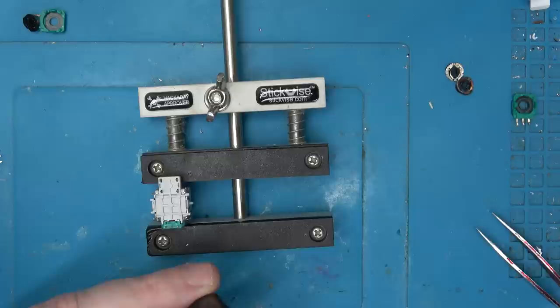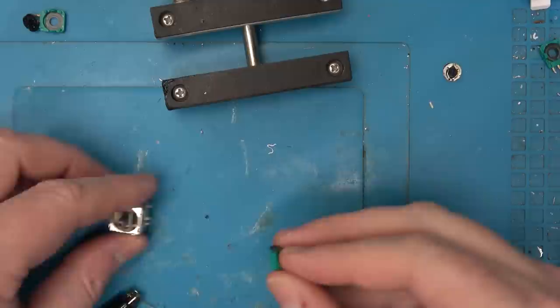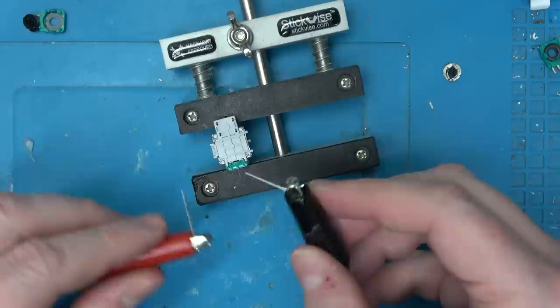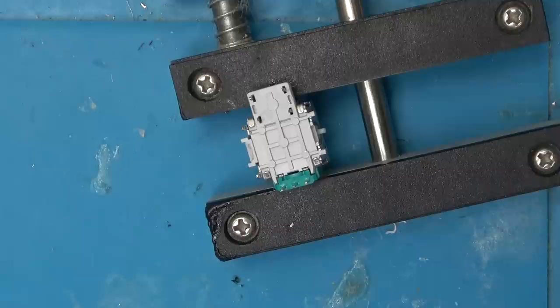I reassembled this potentiometer and loaded it up with three-in-one oil — we're going to make a little space heater. We had some magic smoke! You wouldn't normally have 24 volts going through this, but I'm just doing an experiment. Let's see if we can get some more magic smoke. The difference is this one is dry — no grease. One, one thousand, two, one thousand, three, one thousand, four, one thousand, five... magic smoke, same as before. So I don't think the grease made any difference. It magic smoked at the same rate with both grease and no grease.